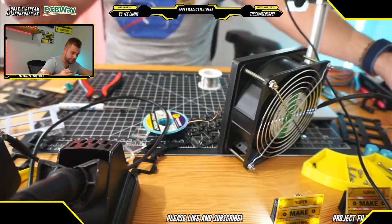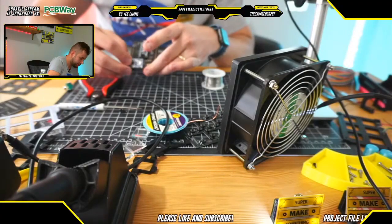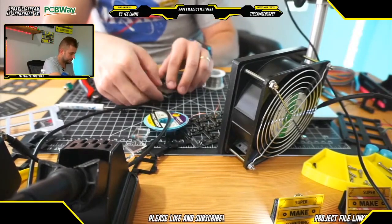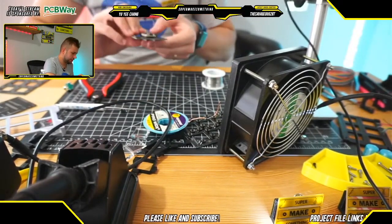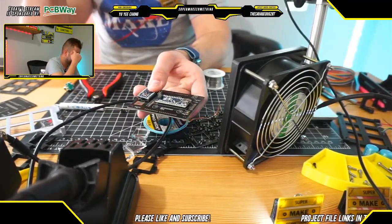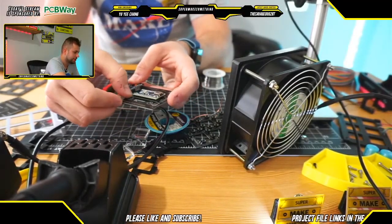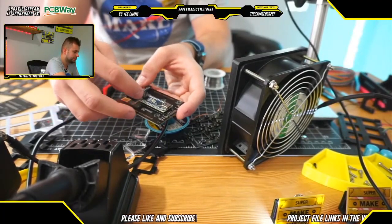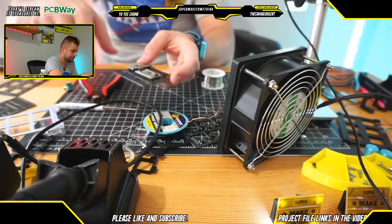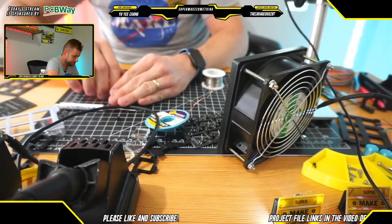All right, with those header pins populated, let us now go and solder this guy onto the board, just like so. And what I might do also is, one of the downsides of buying this particular microcontroller for the Arduino Nano is that in addition to having these connection headers already populated, it also had the in-circuit programmer header populated right here. For the Stream Deck design that we're working with, that unfortunately is a little bit tall.